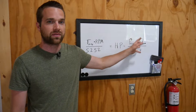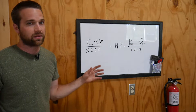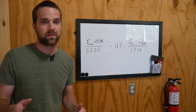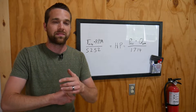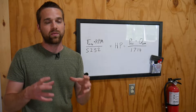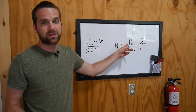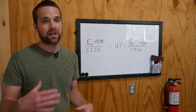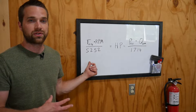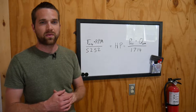The conversion factors depend on the units used. My pressure is in PSI, flow is in gallons per minute, and torque is in foot-pounds. To inspect the system, I broke flow rate into two new variables: pump displacement and RPM. That let me verify the engine RPM feeding the pump wouldn't exceed the pump's speed rating. Combining pump displacement and the max pressure of the pump and hydraulic system is how I found my range of horsepower I'd be working within.